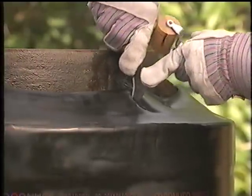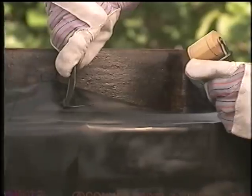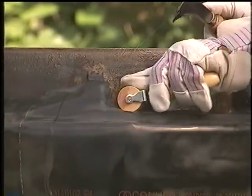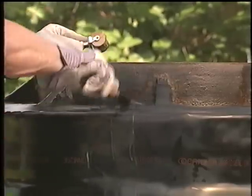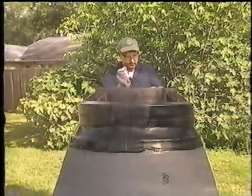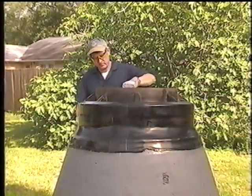After shrinking the sleeve, trim around the frame gussets with a sharp razor knife. Gently heat with a torch and press down the trim sleeve onto the frame. Visually inspect the recovered sleeve to ensure that the Rapid Seal is in full contact with the cone section and manhole frame. Adhesive flow at the sleeve edges is evident and the sleeve is fully recovered.